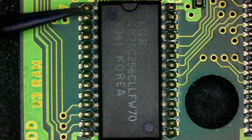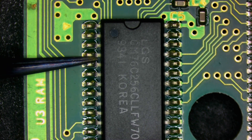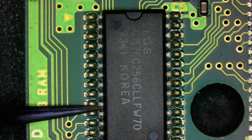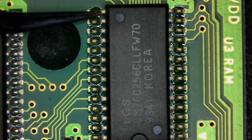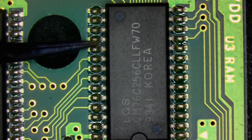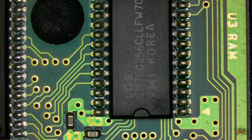I'm going to start over here with the SRAM and very, very gently just give this a nudge — I'm not using a lot of pressure at all. You can see we don't have any movement here so far, everything is still solid. I'm just going to rotate the board around and do the other side. We're just very, very gently tapping — it doesn't require a lot of pressure. You'll know right away if something's loose. All of the legs on the SRAM are good.